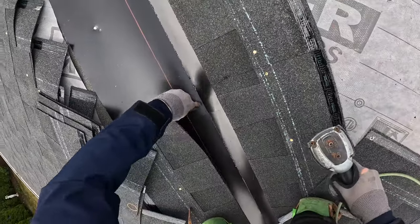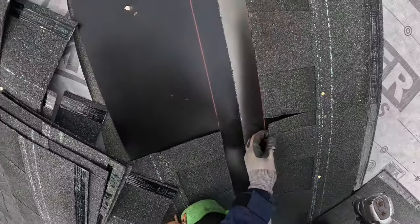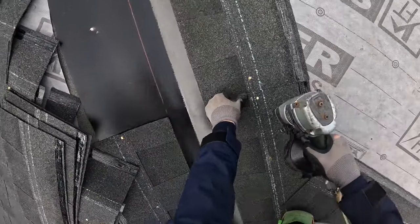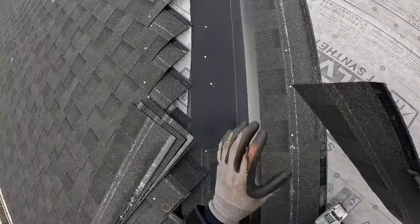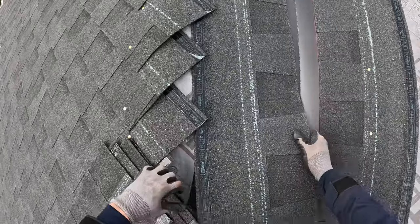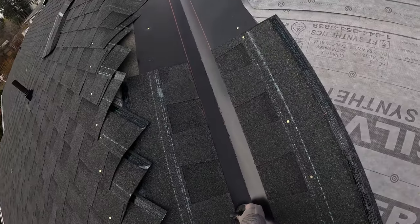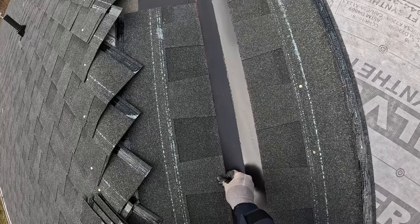Let's see, make it a touch better. Trying to tighten that up. Now we've got shingles in. The tar lines won't matter as long as you're not right down in there. Tight as I can. If you're nailing near the valley, you want to try and be 6 inches up. If you're nailing near it, chances of water running in a pitch like this, whooshing down and up through the metal and nail, there's no standing water in there.